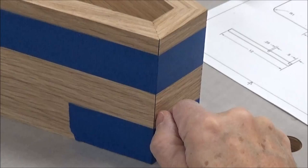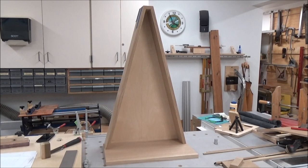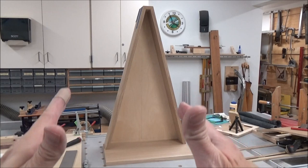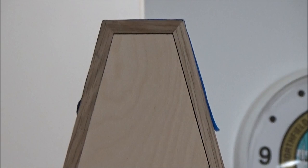I've got a tiny gap at the top — which tells me the sides are just a hair too long. The miter gap up top is good, so if I shorten the legs it's going to drop a little bit and I think that's going to be all right. I'm guessing that gap is about a thirty-second of an inch.